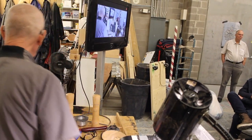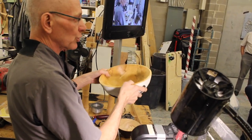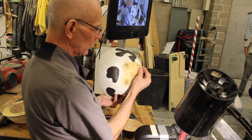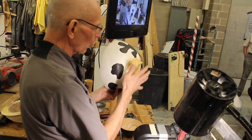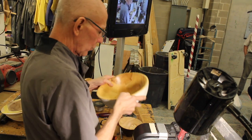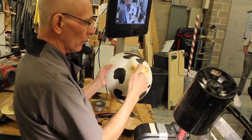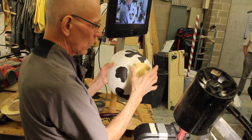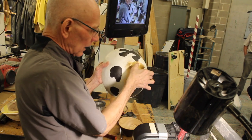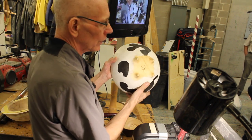The part that's a little bit harder is making sure it sits level, particularly if you're using green wood and it's moving on you. So sometimes I'll leave these a little bit long and not worry about whether it balances until it's completely dry. Then you can take it and go on sandpaper to freshen it up. I've also turned them where I've just touched with three, leaving the fourth one a little closer by itself but not touching, so it still balances more on three teats.